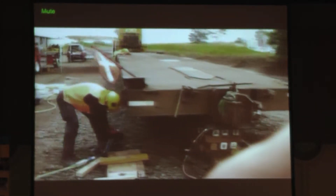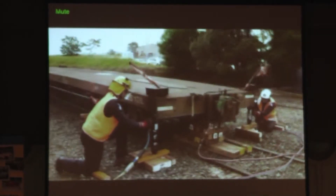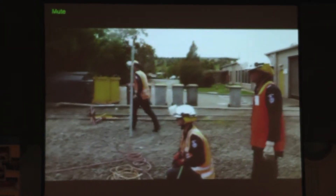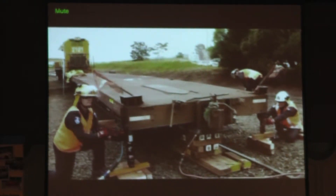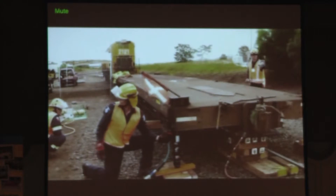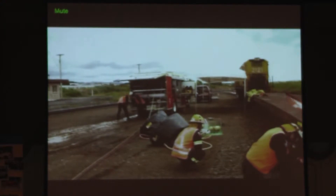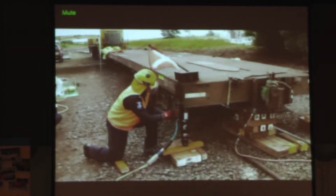You might think, how could that happen? Until Steve Purcell told me about the incident where the patient had been dragged for 50 metres and ended up wedged between the bogey and the carriage, I wouldn't have thought it was possible for the person to still be alive. So it is feasible that you have a patient wedged on top of the bogey and between the underside of the carriage, and what you have to do is lift enough for the ambulance officers to be able to effect a release.